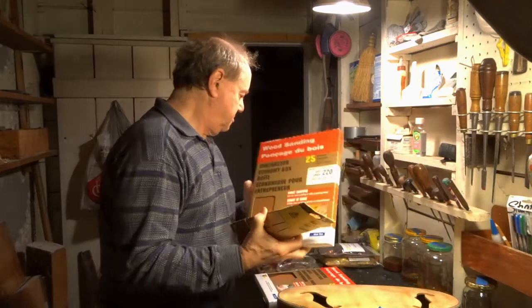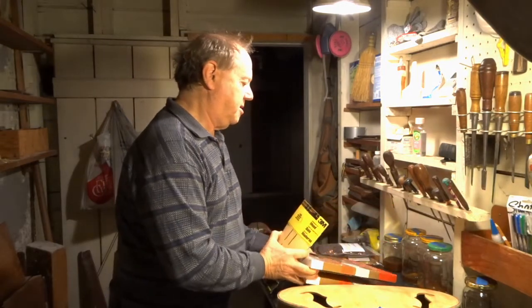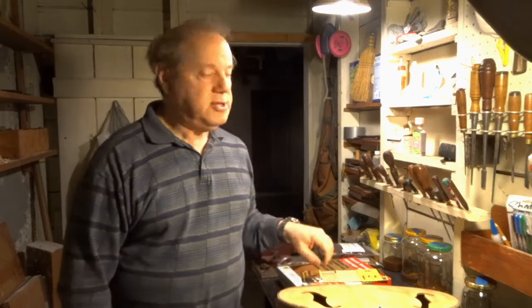Here's garnet — and there's another big box of garnet. The disadvantage of garnet, as probably any woodworker who's used it knows, is it doesn't last as long as modern sandpapers, but it really cuts very well. It creates an open-coated surface that shellac penetrates into very well. I start with 80 grit and go up typically to 220. On some woods I end up going to 320, but 220 is more the norm.